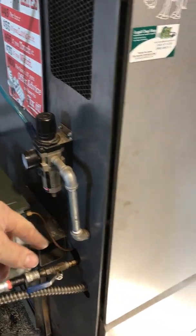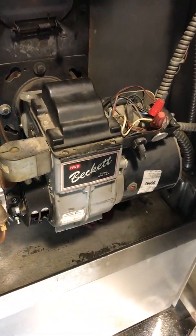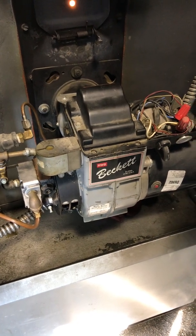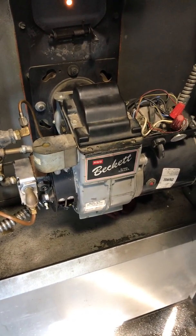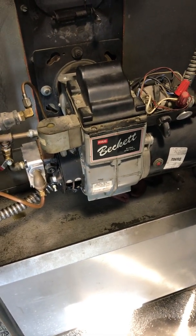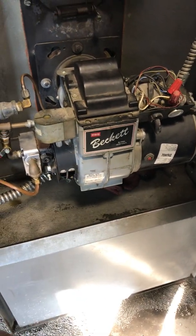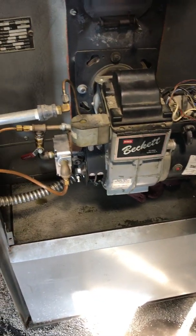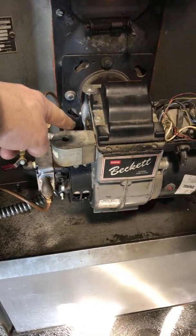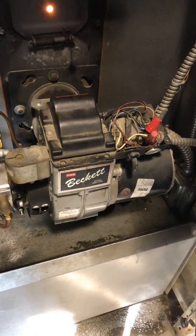The air regulator brings the air in. This is a regular Beckett burner — the kind that you would have already with this furnace. They're easily convertible and very readily available. They're actually made right in the Ohio area, and the company's still in business — parts are still available. The air comes in here under pressure, goes down into the system, into the head, and goes into where the firebox is.